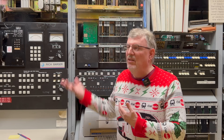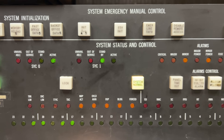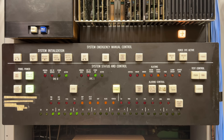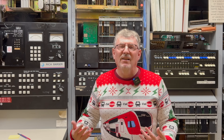In the center of the machine, just below the tape drives, is the system status panel. This gives you an at-a-glance view of the overall health of the machine. The system normal lamp lights up if everything is okay. On the upper left of this panel are buttons that allow you to hard reboot the machine in an emergency. There are several levels of reboot, which Western Electric likes to call initializations, and they start with the lowest impact type and get progressively more drastic if the problem is not solved. Normally, initializations are carried out under software control, but a human might need to use these buttons if the machine is totally locked up.